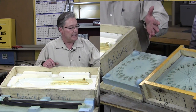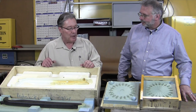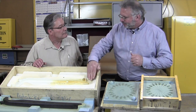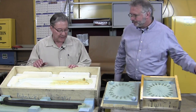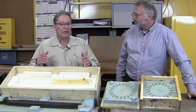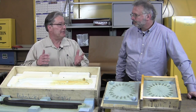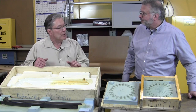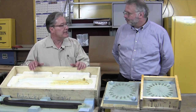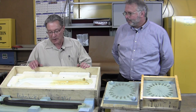The silicone rubber is poured when we build these — we buy silicone in 55-gallon drums with a meter mix unit on top that mixes the A and B portions and we pump that into the tools. For casting urethane, on a part this size we use a meter mix machine that mixes the resin and hardener together through a static mixing tube so we don't introduce any air while mixing. You could mix urethane by hand, but you'd need to degas it to get the air bubbles out. We also use a pressure tank — we pressurize the silicone rubber when building a tool, and for larger parts with enough cure time we can pressurize the urethane casting as well, which helps eliminate any air bubbles in the finished part.